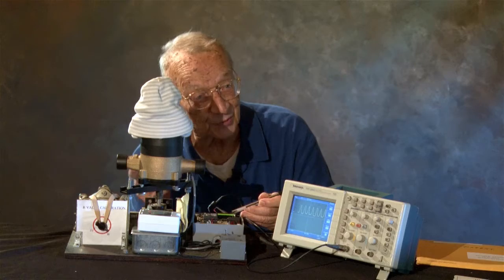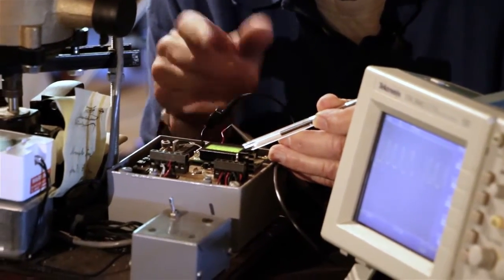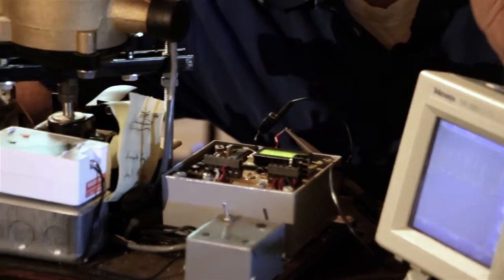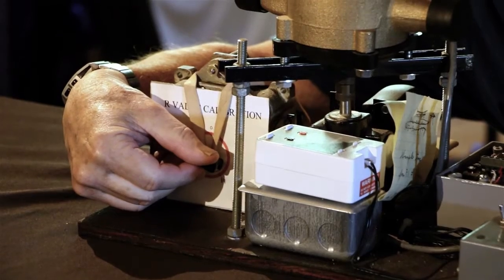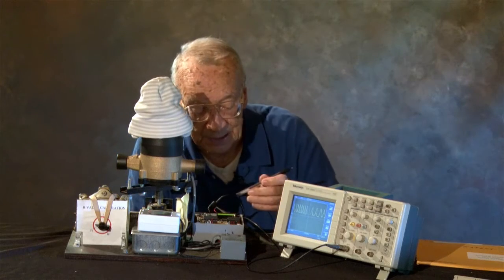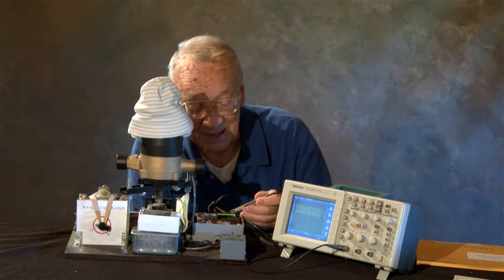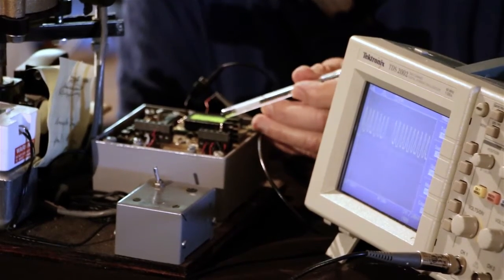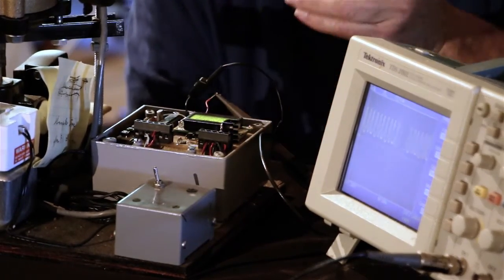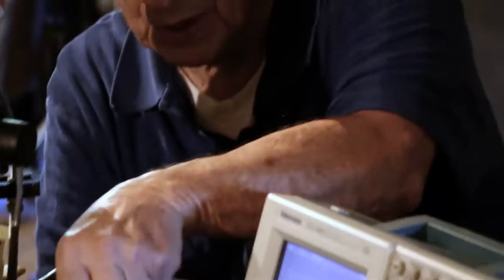If I increase the flow of water through this, we will exceed that threshold and we will get an alarm. It actually takes two consecutive detections to generate an alarm. So we had about half a gallon flowing there. When it exceeds the flow setting, it first comes up as a ready indication, meaning it's ready to go into alarm. If it happens twice, we're going to have an alarm.